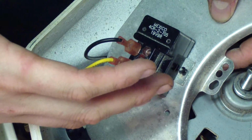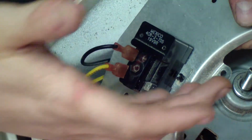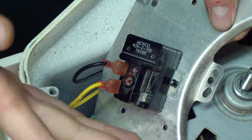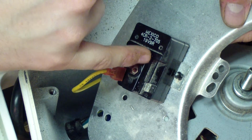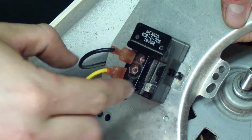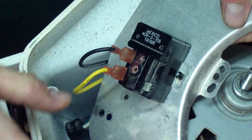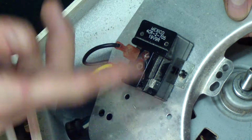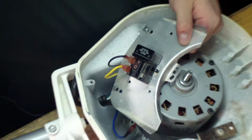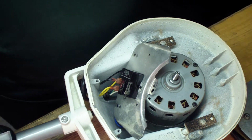And the only way for that coil to be energized is the inrush current, the big giant surge of current. Like if you have a stalled motor, where no start windings are being energized, you just hear a hum, and it builds a lot of current because it's not moving, because it's under stall. That giant amount of current surging through energizes the coil inside here and pulls the contacts, and then brings contact over here to the start windings. Once the motor gets going good enough, the overall current level drops down, and then the relay releases the start windings, so only the run windings are running once the electric motor gets up to speed. That, I don't believe, is what's going on here, and actually, for a fact, I'll just tell you right now, I know it's not what's going on here.